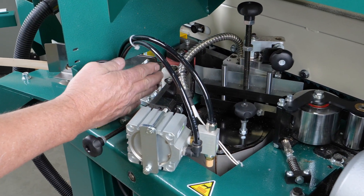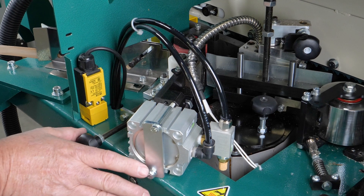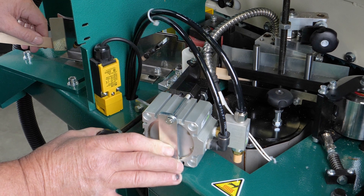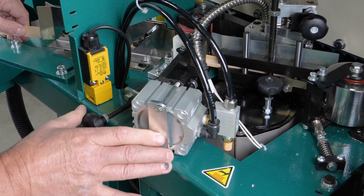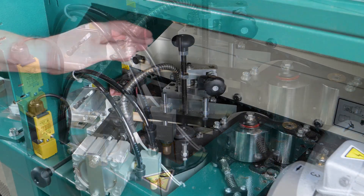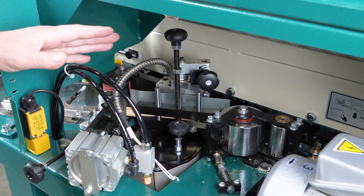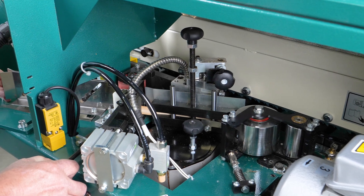Now we're looking at the nylon feed rollers for the edge banding tape. This is the nylon roller and the rubber roller which is behind. The rubber roller is stationary and the nylon roller is movable — just grab the handle and move it to the right, which slides it out so you're able to advance the tape through into the intake guide. After advancing the tape forward, release the knob and verify that this upper guide is just barely above the edge banding tape. This adjustment knob for the seat assembly adjusts this upper bar up and down, and you want it set so it's just above the edge banding tape — feeding freely through the guide but without any extra play.